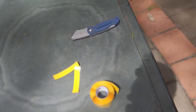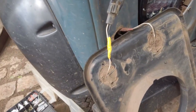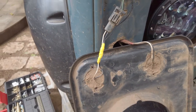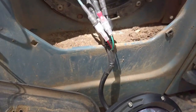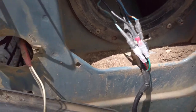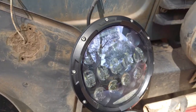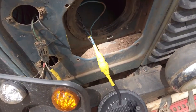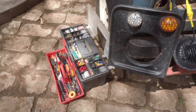These days I got a little bit better. I don't use insulating tape but this silicon self-amalgamating tape. Once you've wound it on, within 24 hours it will amalgamate into one solid piece and it's completely waterproof. So now it's heat shrinked and then we're going to wrap it like that, and then we're done. You can assemble the light and get on with life. Here it is wrapped with self-amalgamating tape — within 24 hours it will be completely solid, one piece.